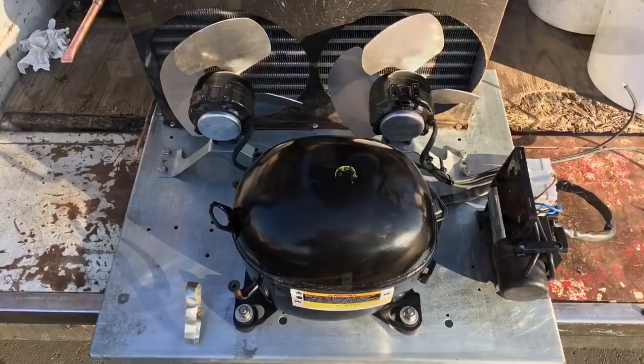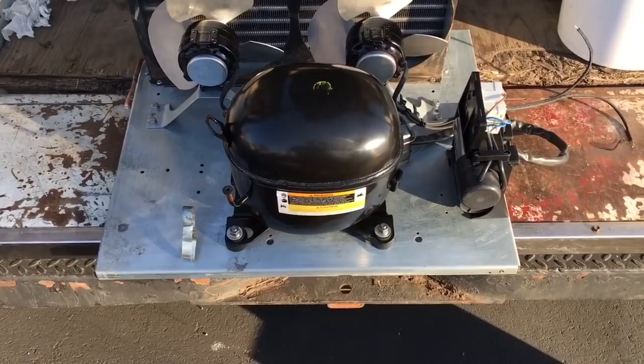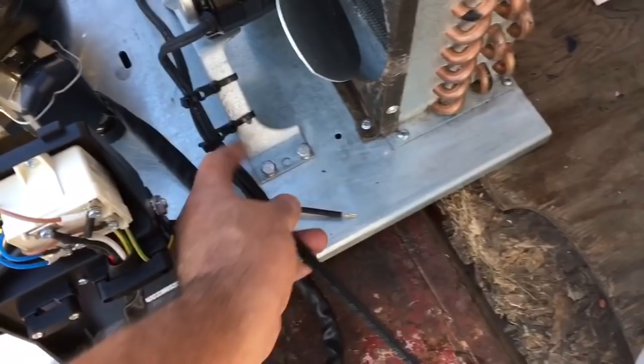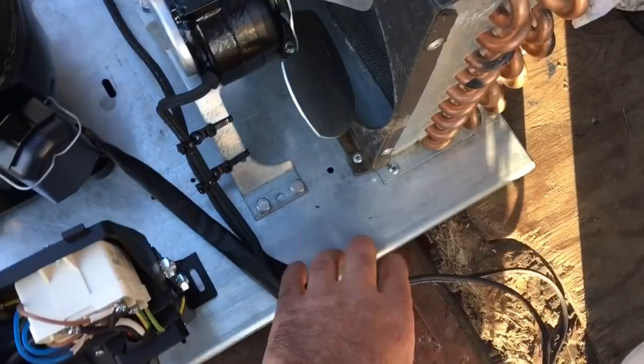Rebuild's coming along. Got the compressor in. Electrical box comes with it. Pretty cool. Got a wire in the electrical though from the other one into here. Condenser fan motors, got to figure out how I'm going to do those clean. I think I'm going to put a terminal strip along here. Do them on there or something. We'll see. Sorry about that, guys. Anyways,